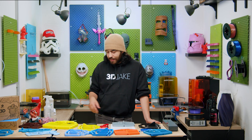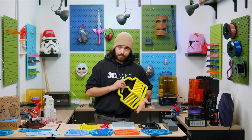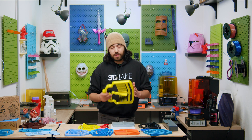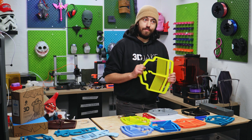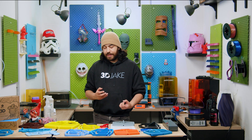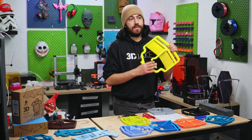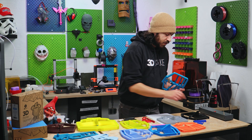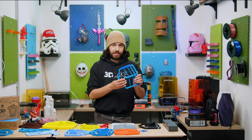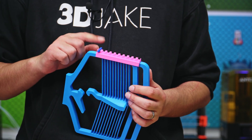It seems PETG is actually the best material for this particular design. I've tried Bambu Lab PETG, Filamentum PETG, and ColorFabb PETG, and they just don't work as well as ours. So if you're going to make a high-powered compliant mechanism in a similar design, use our PETG. This design is now up on Printables — download it, use your favorite PETG or other filament, and report on the results. We also added a rudimentary charging handle for quick cocking, and a dart holder that clips onto the top so you can keep a dart ready for quick succession of shots.